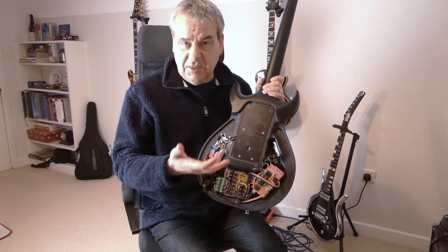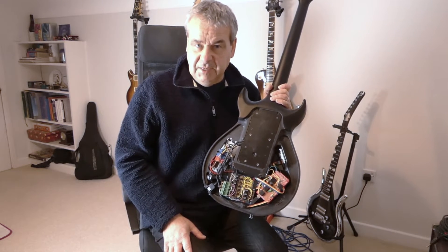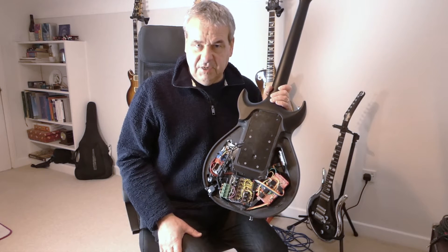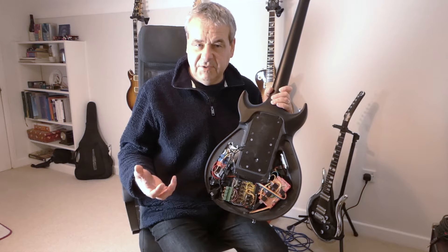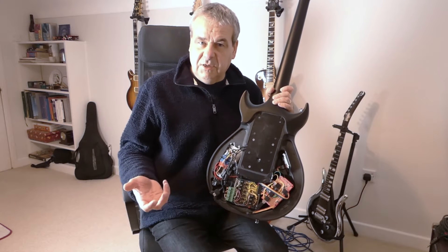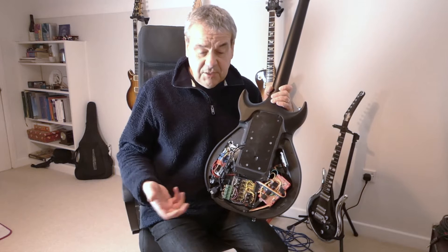It's quite an old processor. I started this project about seven or eight years ago. It was a complete failure when I first started because I tried using digital potentiometers, and without thinking about it, realised that's not going to work on an AC signal that goes below zero. So I soldiered on.